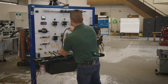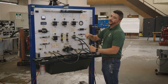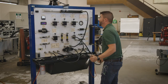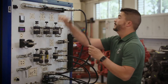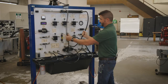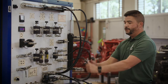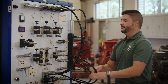I'm going to run a line up to one of my cylinders. Up here we have a cylinder, or what we call in college a linear actuator. We'll hook a hose to it. So now I have a linear actuator connected and over here I have my relief. If I'm in class checking on students, they would get to this point hopefully and I would check: first off, do they have a relief? Even if they hook this up wrong, the relief will protect the system.